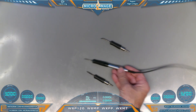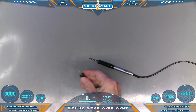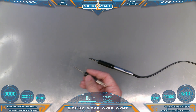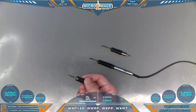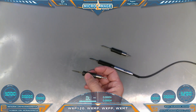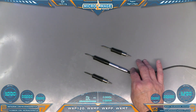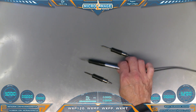I'll often switch to what they call the bent chisel — it's more like a conical, but surprisingly it delivers heat very well even at the very tip. I also have just the straight conical, and again it delivers heat all the way to the very tip, which is often very shocking because you don't typically expect that. This iron on the regular surprises me with what it can do. It is a 40 watt pico iron, so it can't do everything, but it will surprise you. It is by far my favorite iron purchase.